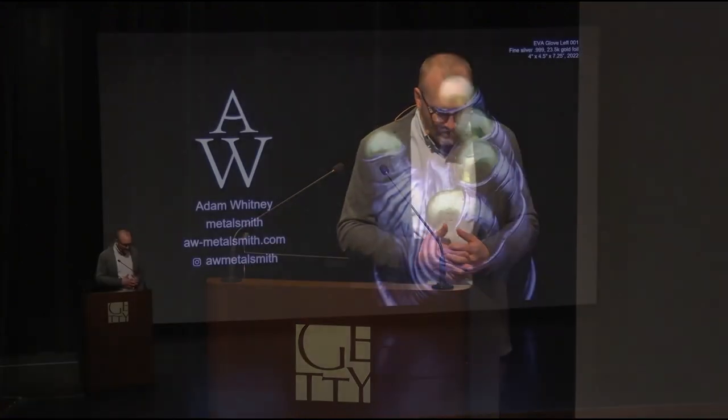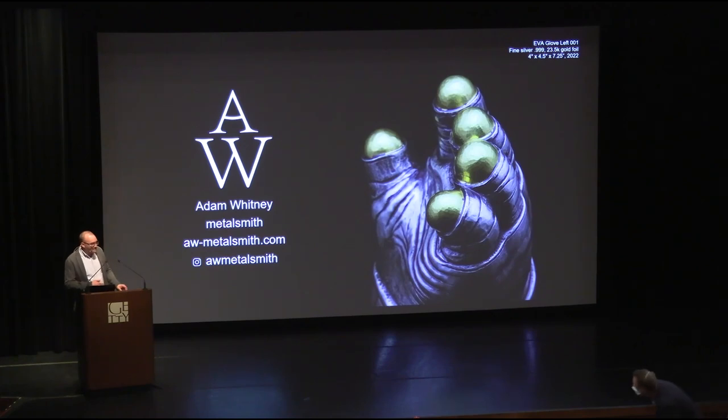Question from Zoom — from master conservator John Twilley: Are you annealing and soldering using oxygen mixed with your propane or just straight propane? And do you use boron-containing torch fuels? What I use is propane from the local hardware store — the same one you cook with on your grill — because it's cheap, about 15 dollars. I hook it up to an ambient air torch, so it's a single fuel torch — just propane grabbing oxygen from the air. I'm not adding a tank of oxygen, which would make that flame much hotter and more aggressive than needed for my process. Single fuel, just propane. I don't know exactly how clean that propane is, but we eat with it, so it's got to be decent.